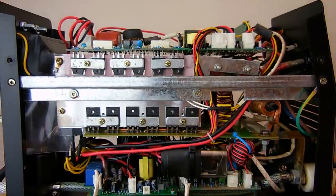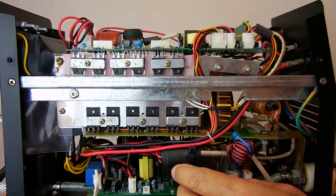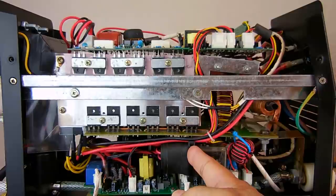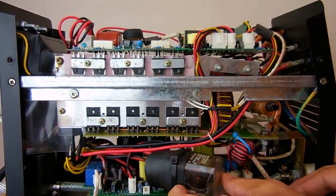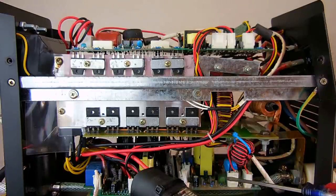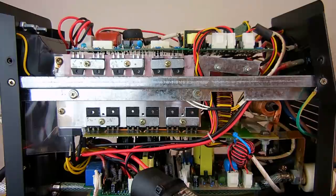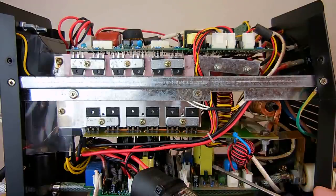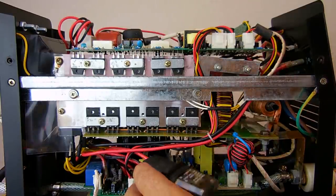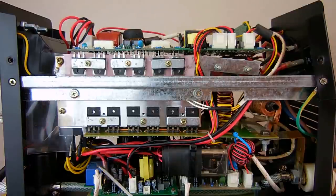I have the board reinstalled inside the plasma cutter. Over here is the replacement relay that I used and I applied rubber around where the terminals go — it fits very nicely tucked inside the unit. Before putting the other board back in, I decided to inspect that board which controls the solenoid for the flow of air into the nozzle. It has a relay, another transformer, two MOSFETs, an NPN transistor, along with a couple of resistors and diodes. I tested out everything on that board to rule out any problems there as well.